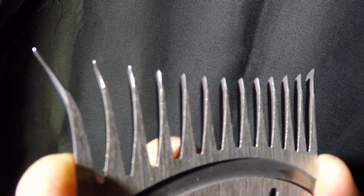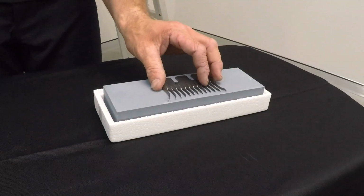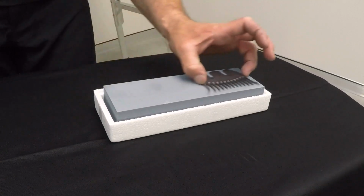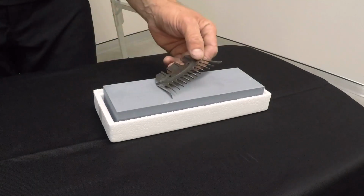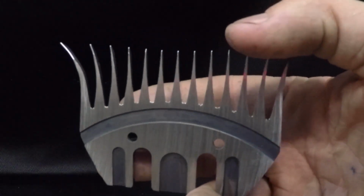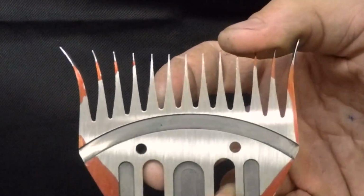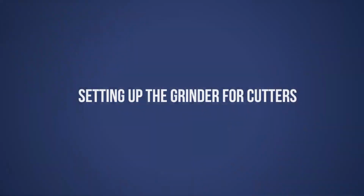A simple method to identify a correct hollow in your combs is by using no downwards pressure and only the weight of the comb. Lightly rub the comb from side to side on a fine Heiniger silicon carbide checking stone. In good light, you will be able to see that the stone has made contact evenly and should touch along the left and right sides at the top and the bottom.